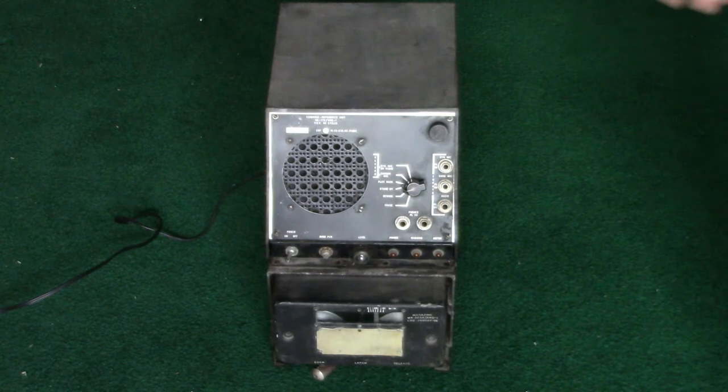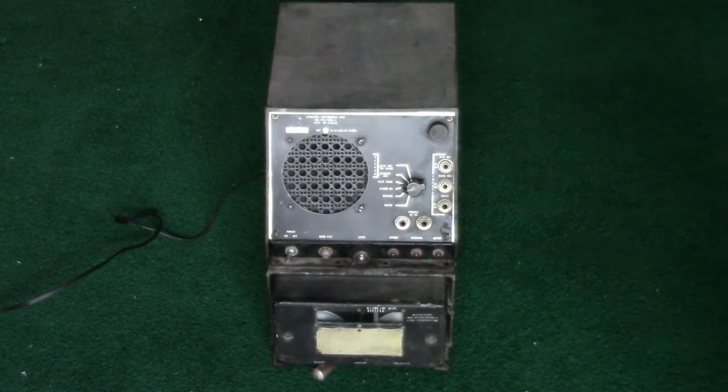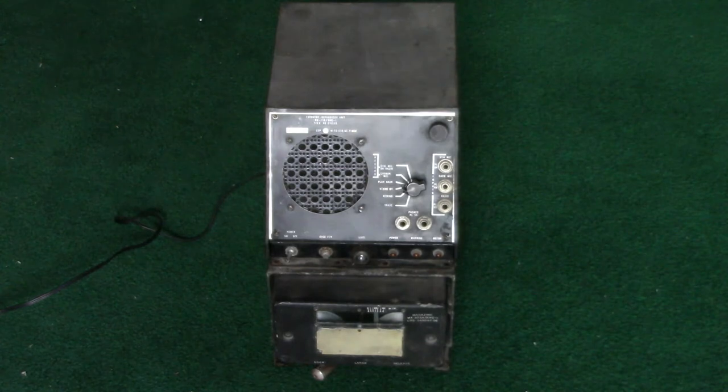Keep in mind that this machine is running with all the original capacitors. As a matter of fact, it is running with all the original electronics. The only repairs that were done were to put a new wire into the head cartridge, do a couple of splices after the wire snapped, and repair the speaker, and of course some lubrication of the mechanics. All the other electronics, aside from the burned out power light, are good. Capacitors, resistors, it's incredible. Absolutely incredible.